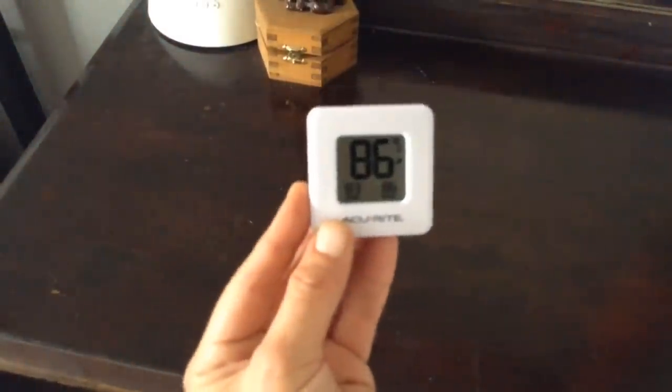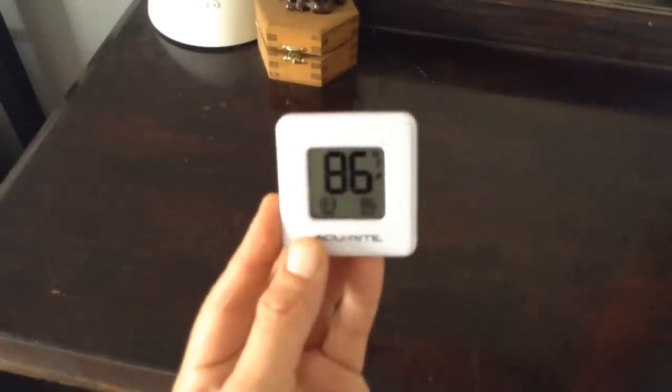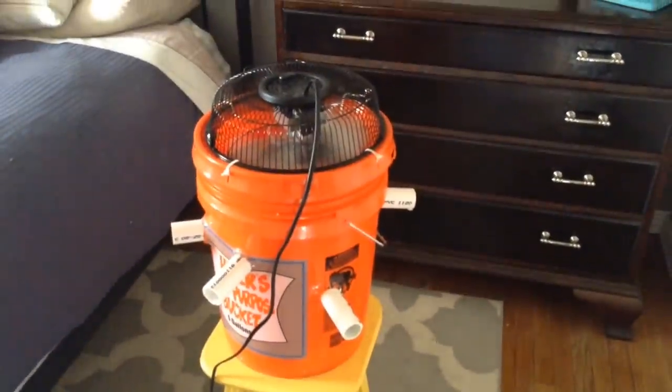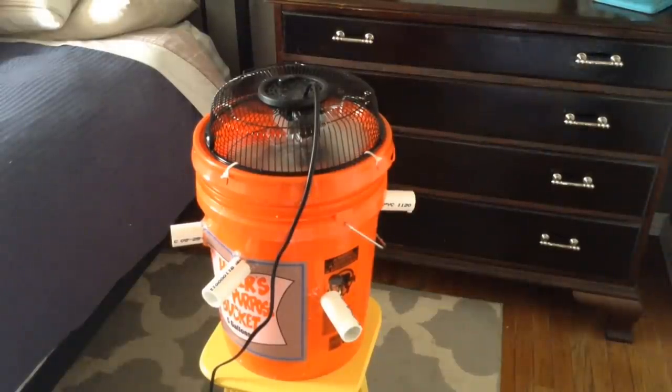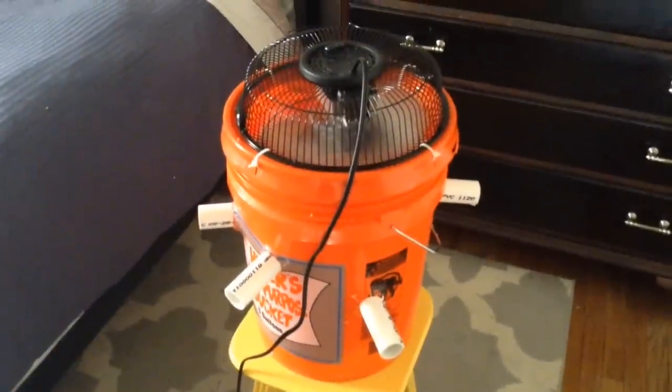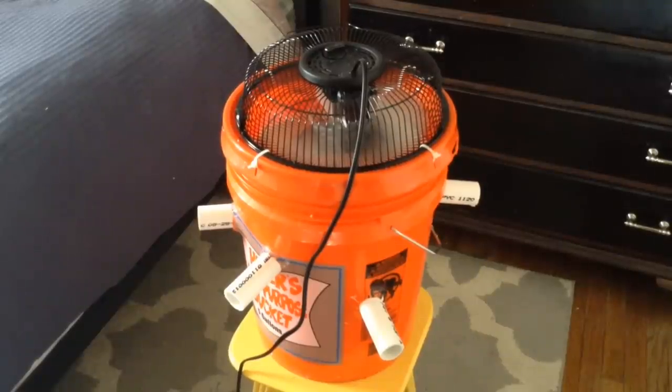Currently I brought a temperature gauge — it's 86 in here, so I'm guessing it's going to go down real nice pretty soon. For optimal efficiency, you want to close any windows, any draperies, close any doors like bathrooms or closets, and close the entrance door. It's kind of like if you're in an extreme winter storm and you bundle yourself up in the smallest room to keep warm through body heat — well, this is the same principle in reverse. You're going to want to place it in the middle of the room so the air distributes evenly, and make sure the room is closed off.